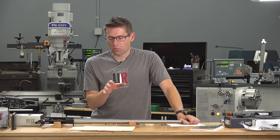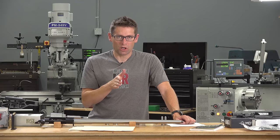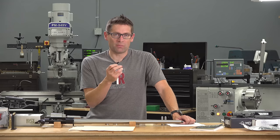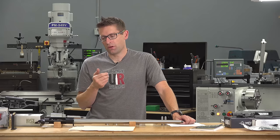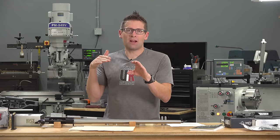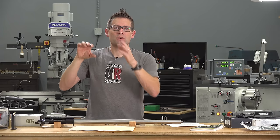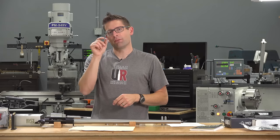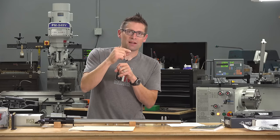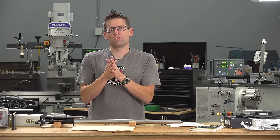I repositioned the barrel so about three inches of barrel blank was protruding from the edge of the jaws — I didn't want the jaws to distort the barrel where the chamber was going to get cut. For indication I worked right under the jaws: move the jaws radially, then move the indicator out and indicate further out, then tip with the spider end to influence the outboard portion. You can think of the jaws as a fulcrum of sorts — tip the barrel outboard from those jaws with the indicator, fix that, go back to the jaws and move them radially again. My goal was to be within two ten-thousandths of an inch total indicator reading.